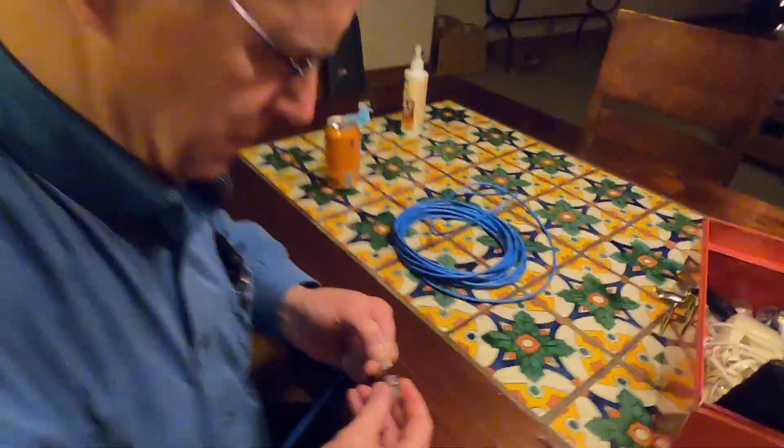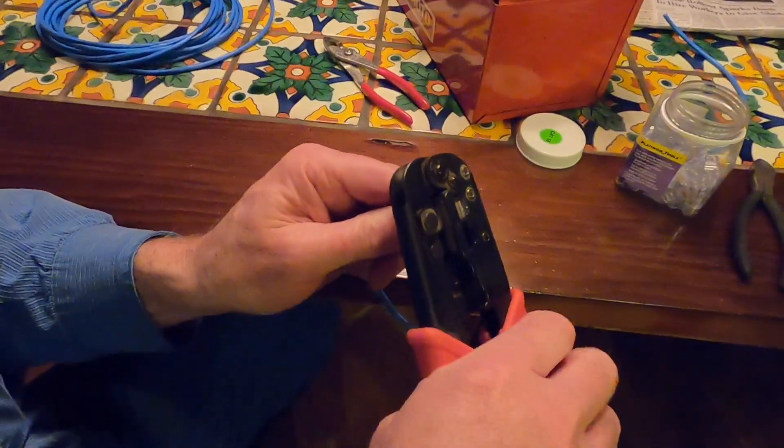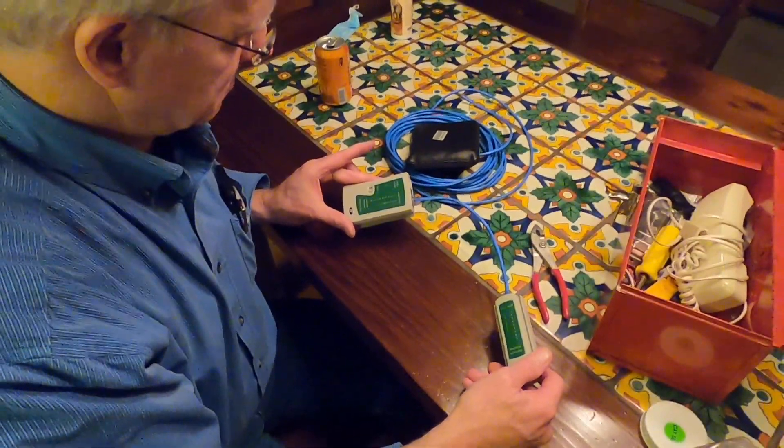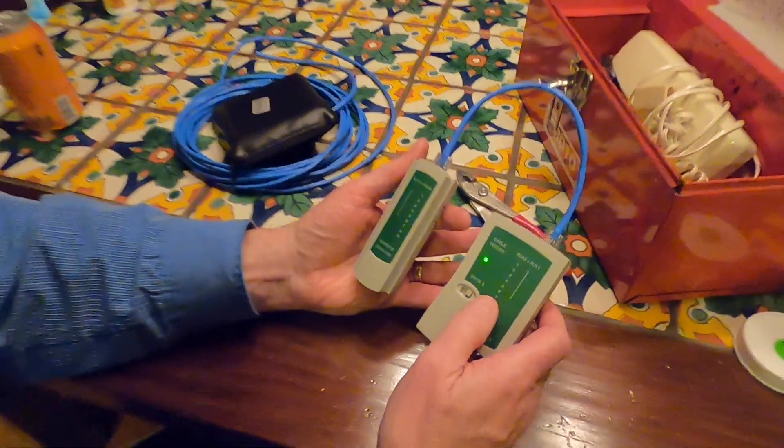The Renogy smart lithium batteries need an ethernet cable attached between each one and then to the monitor screen, so that we can monitor all three batteries with the same screen. I happen to know that my dad, the network guru, has all the tools required to make our own short ethernet cables. So we're here at Christmas with the family and he is working on building us some ethernet cables — got to get the wires all in the right order. Last step is to use a special crimper tool, and then he uses a tester to make sure the order was done correctly and the crimps are set. So we got a good cable. Thanks, dad.